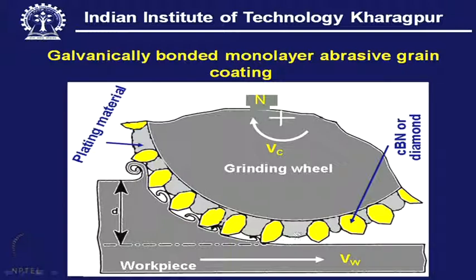For holding the grit in place with the electroplated or galvanic layer — in most cases a nickel galvanic layer, or nickel phosphide in electroplating — this layer has to be raised at least two-thirds or 70 percent for adequate holding. So though we get 30 percent protrusion, considering the requirements of grinding and high expectations, this does not give us the best possible solution for grit-holding capability and chip space creation.